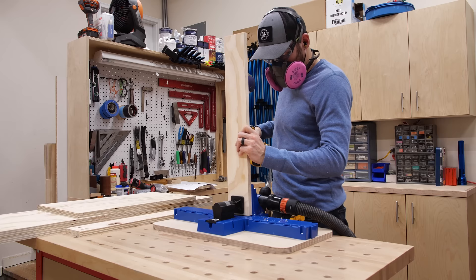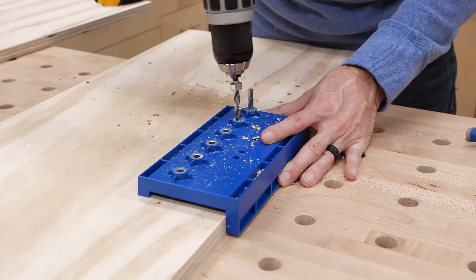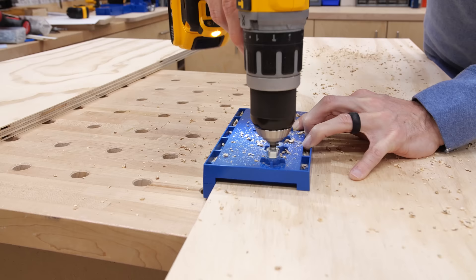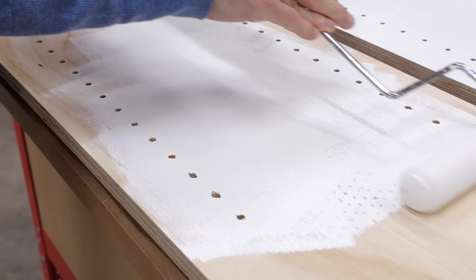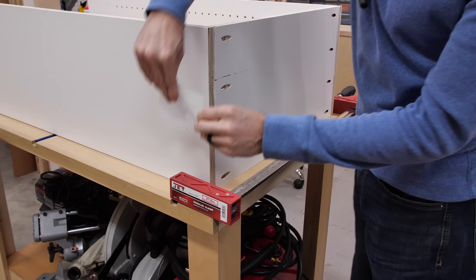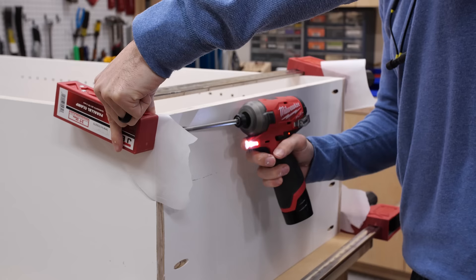You could make fixed shelves for the hutch but I prefer adjustable shelves — because you never know when you might want to move one an inch and a quarter higher. Honestly I'll put them in place and never move them again. Let me know in the comments: do you actually move adjustable shelves or are you like me and want the flexibility for peace of mind but never use it? After drilling the shelf pin holes I painted the sides and top before assembly — it's way easier to roll the parts as panels versus brushing into corners. When dry I clamped the top between the sides and secured it with pocket screws, using wax paper between the sides and clamp heads since the paint wasn't fully cured, to keep the clamps from sticking or embedding wood chips into the soft finish.